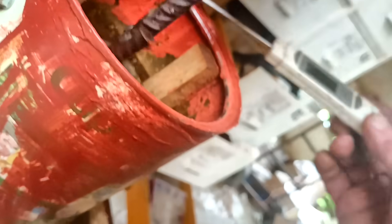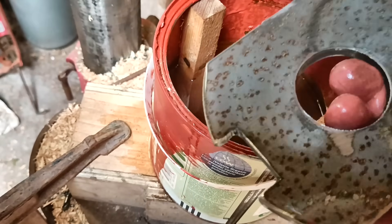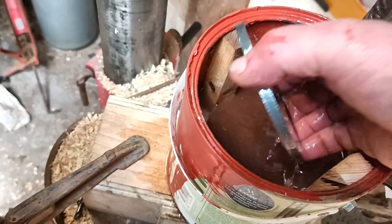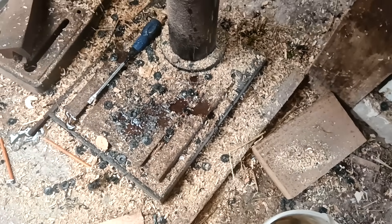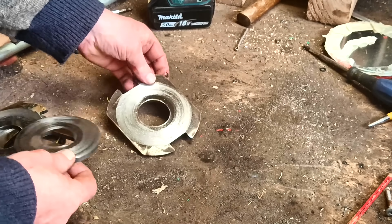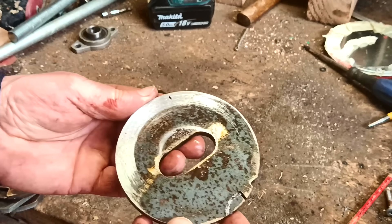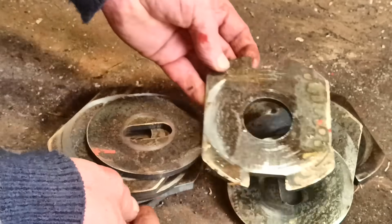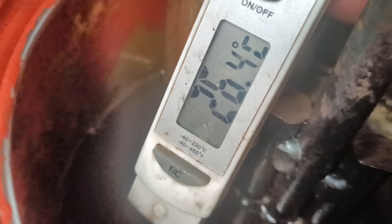By that time the temperature had risen to 31°C — more than 12 degrees in four minutes. Not too bad. Remembering that it isn't just the water being heated — it's all that steel too, about two litres of water and steel combined, not to mention the paint tin and the surrounding air. The only real problem was the rebar causing too much vibration and jamming, and you can see how uneven the wearing is on the plates. So I eventually found some smooth round bar and made a new drive shaft, which made all the difference — much less vibration and leaking.